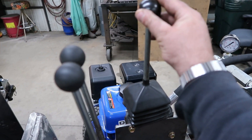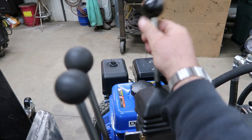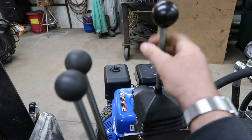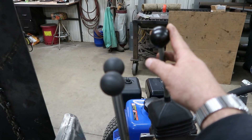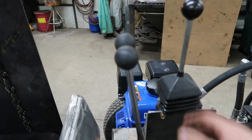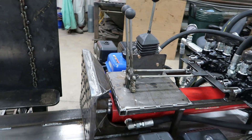There are two auto-return valves and a flow control valve that feeds a four-way loader valve. With the loader valve, float is log-lift down, log-lift up, hydraulic wedge down, hydraulic wedge up — eliminating one lever there.